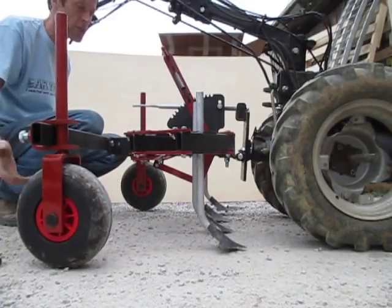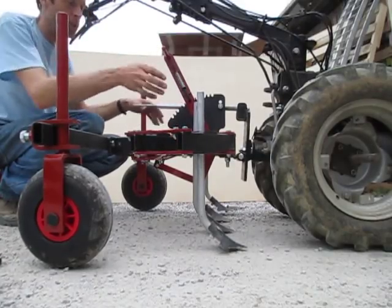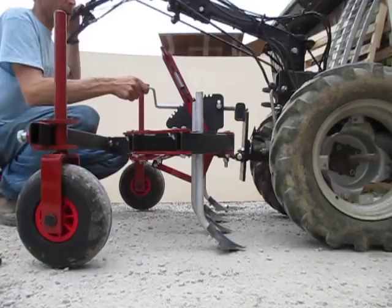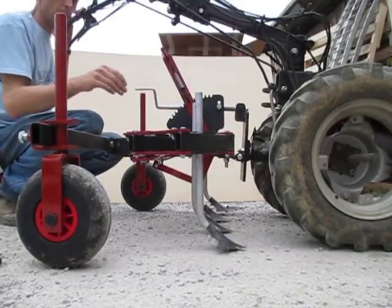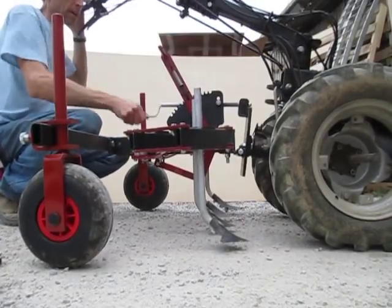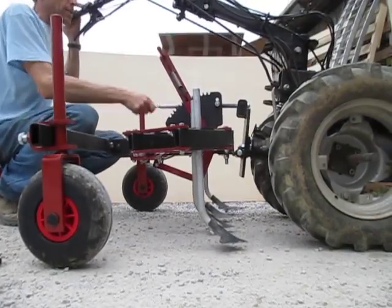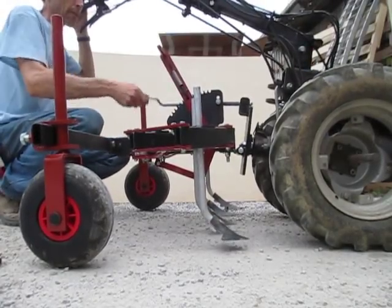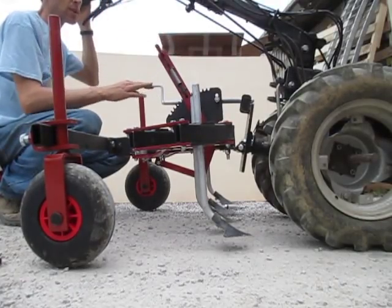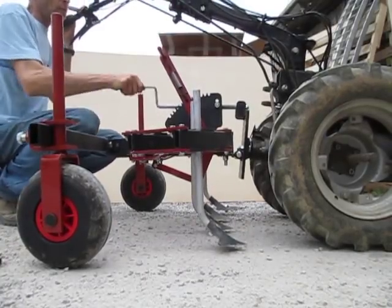With the wheels jacked up a little, let your shanks all the way down to the ground and then tighten the little bolts down here that hold the shanks in place. Then, to get those shanks up off the ground when the wheels are back down on the ground, just crank it up like this and raise those shanks up for a transport position so you can get out to the field. When you crank it down, your engine gets closer to the ground, but usually that's not a problem when you're just traveling. When you crank it back up, you get a little more engine clearance.